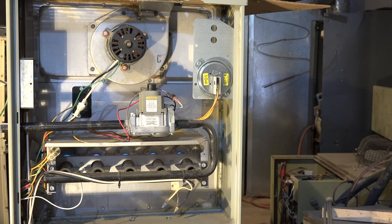After about a 30-second time delay the fan motor is going to come on. Now, because we have the duct blocked off, it's not going to be getting enough air through there to run safely, so the furnace is going to limit out.